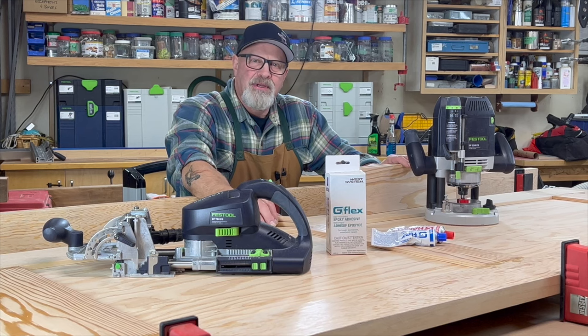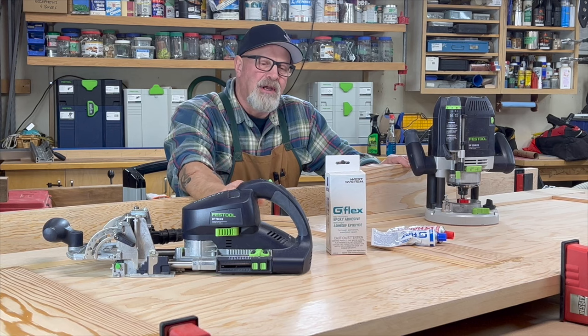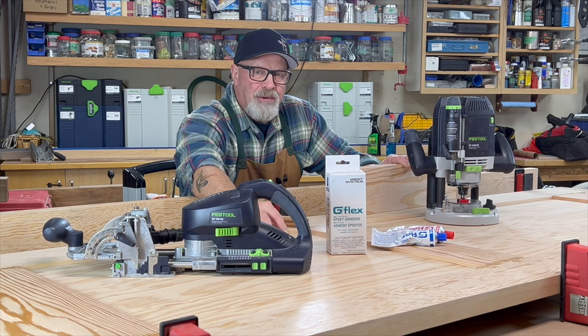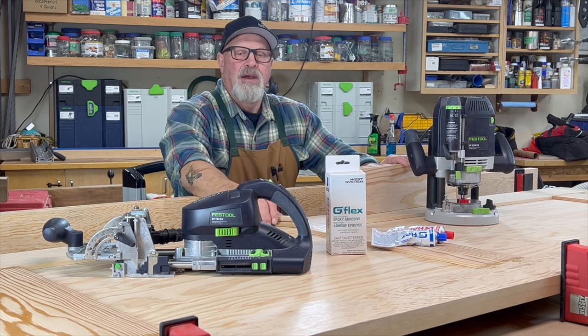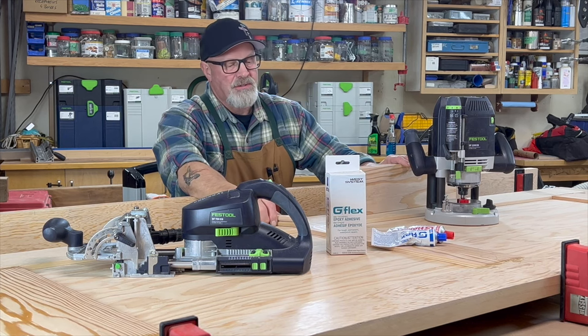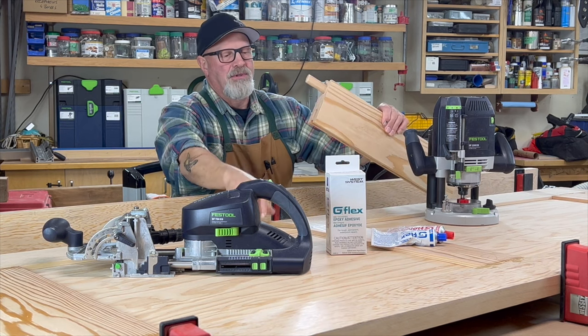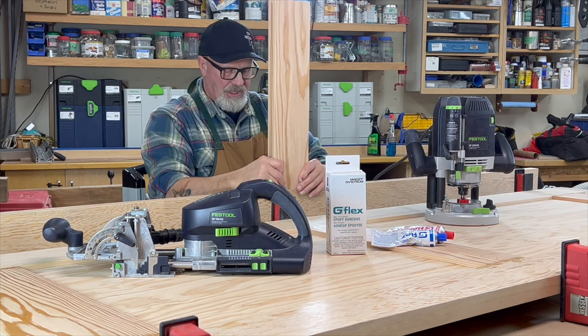So what I'm doing is I'm making shaker panel doors using 2x6 and 2x8 Douglas fir, as well as some half inch marine grade plywood, also in Douglas fir. It's going to be weatherproof once it's primed. I'm using the Domino 700 machine to make the joints between my rails and stiles. Domino will just insert in the rail and then the rail into the stile like so.